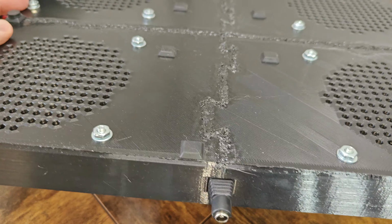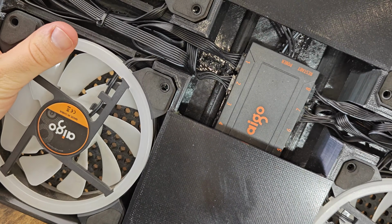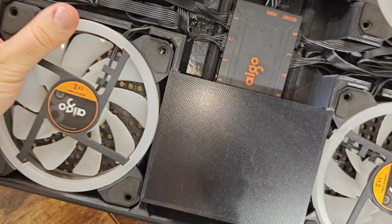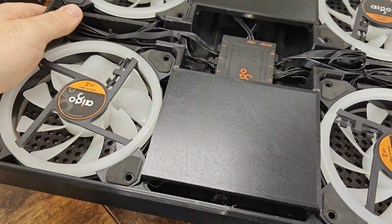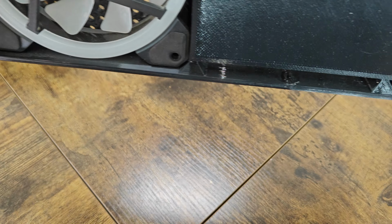As you can see from these examples, the resulting weld shouldn't look too far off from a standard stick arc weld in metal. Also, we don't necessarily need a large gap between the parts to be welded. We can actually get away with some pretty makeshift ways of holding the parts in place while welding.